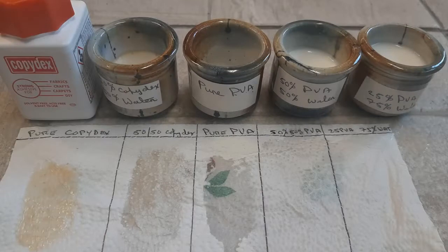Well, you can hear how bad and scratchy the sound is currently coming from the speakers. So the plan is to make a new suspension ring to support the speaker cones. And to this end, I'm going to make a reinforced paper ring out of kitchen roll. Here I'm experimenting with various glues to find a possible type that'll be strong enough but very flexible. And the only one that actually proved suitable was this one on the far left. It's called Copydex, and it's a latex rubber adhesive that I think should do the trick.